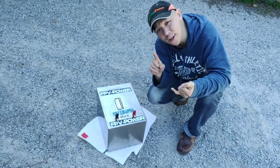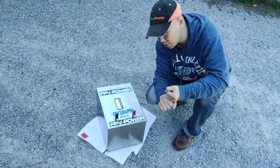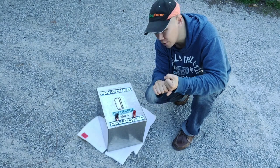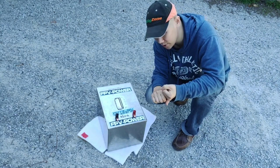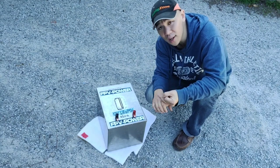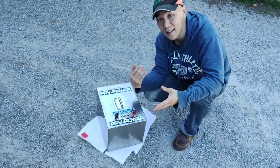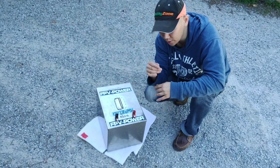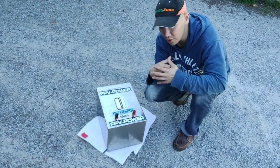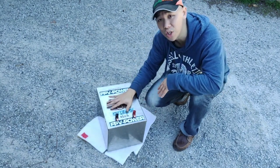So what we will do is change his solar charge controller to an MPPT. He's using PWM, which is not a very good conversion, losing a lot of power and efficiency there. So we're going to go with the MPPT solar charge controller, and I'm also going to do a DC to DC charge controller from his car. There will be a smart switch which senses when the engine is started, then the alternator is going to charge this battery, and you can set what amperage you want to charge at.